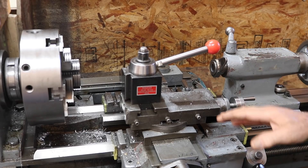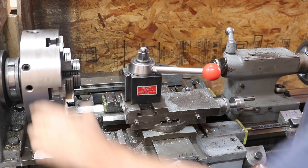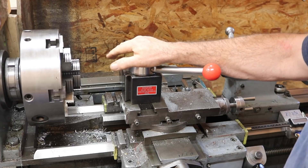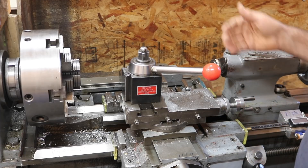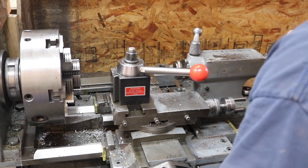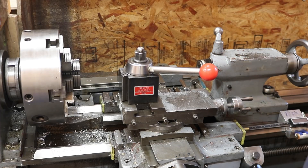Check out Gary's channel — description in the link below — and subscribe to his channel, and subscribe to my channel please. This is my Lance lathe, a 16 by 60 lathe. This is a 10-inch 6-jaw chuck, just for reference. This is a CXA tool post, and this is the tailstock. The drag link idea is that I'm going to be able to pull my tailstock with the carriage using the automatic carriage feed to feed a drill bit in, dragging the tailstock along with the carriage.